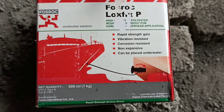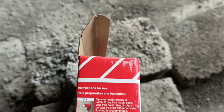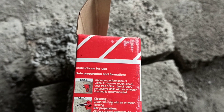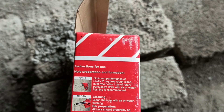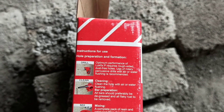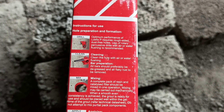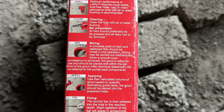The complete pack of resin and filler must be mixed in one operation and it should be carried out by mechanical means for getting even consistency. After getting an even consistency, the grout should be injected into the hole and the steel bar is then pressed into the hole to the required depth. The bars should be slightly agitated to make the grout reach everywhere in the hole.